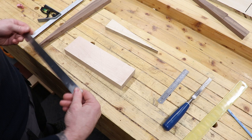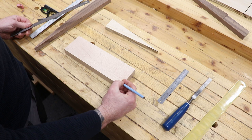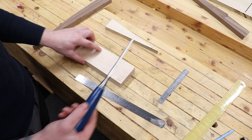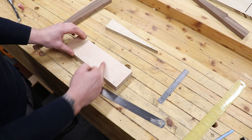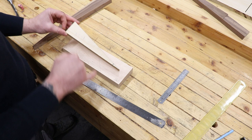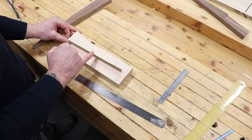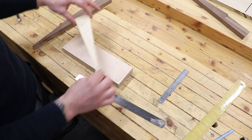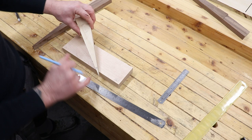Let's get marking this out. This is the back of the plane - we call that the heel - and this is the front. I've measured up seven inches to this point and drew a line at 45 degrees; that's going to be the bed for my chisel to sit on. Now we want to establish another angle for our wedge piece. I've made a guide from plywood - it's a ratio of four and a half to one, so across nine inches and up two inches, which establishes the correct angle I need.